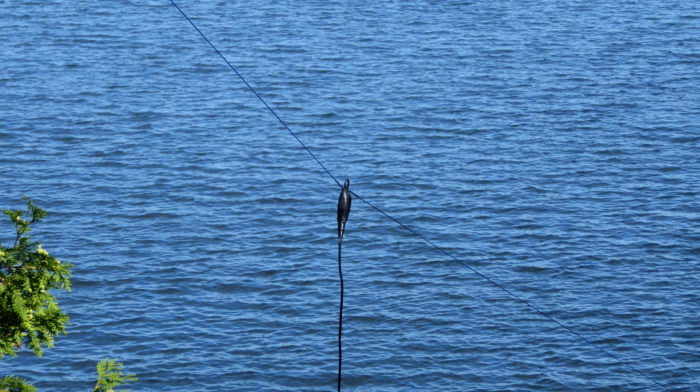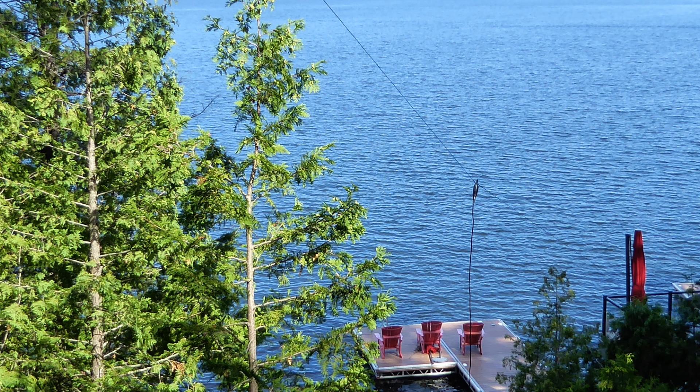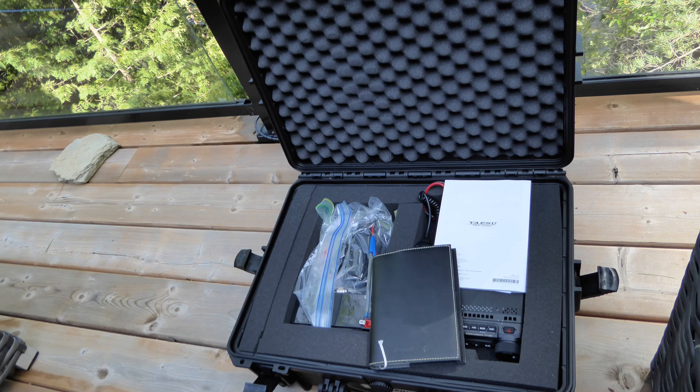As witnessed on the 40-meter band with little activity and with only 20 watts out, my compromise station made contacts to Ohio, Virginia, and Massachusetts. That's pretty darn good in my estimation. My takeaway from this exercise is that portable operators should not overlook similar options going forward. Weigh your choices carefully, but if it turns out that sloping an antenna down a steep hill away from the operating location is the best one, don't dismiss it out of hand — that deployment could work out better than you think. That's all for this time. Thank you for watching. Now it's your turn — get out of the shack, get outdoors, and get on the air. 73 from Tracy, VE3TWM.